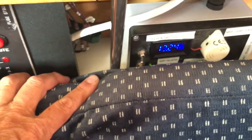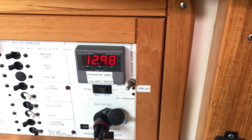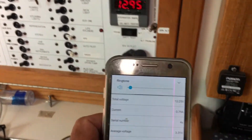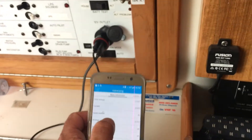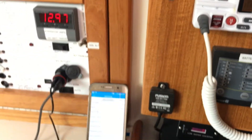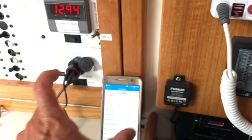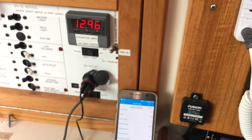For most people — especially non-professional electricians — it's probably best to stick with a decent-sized lead-acid bank for navigating and running your autopilot. But the lithium will most of the time run most of your loads. Also, don't run a lead-acid charger when your banks are combined — unhook and disconnect those two banks before charging. But you can parallel them if you start paralleling when you have a high state of charge on your lead-acid battery. That will work in my experience.